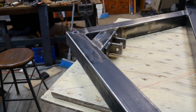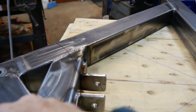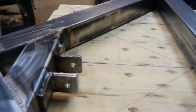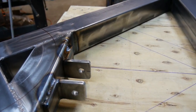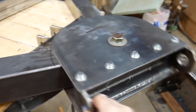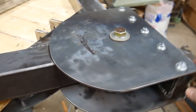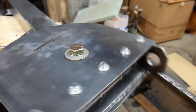Just a real quick view of some of the work I did today on this. See this cross piece in here – you see the circular mark – that's where the indexing piece goes in to hold it. These tabs here I haven't finished welding because I ran out of argon gas. This is where a shock absorber attaches and goes up to a mount – so it's a spring and a shock absorber. This end piece is the part that swivels – see the pivot. It's actually going to have some form of UHMW bearing tape in there. It works pretty slick – it's got the big bushings in it, a three-quarter-inch bolt.